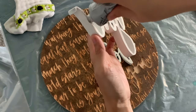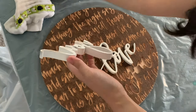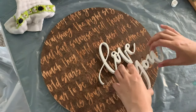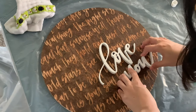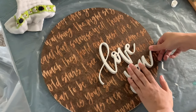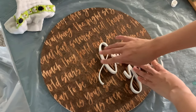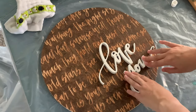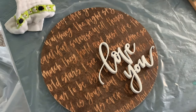I went around the edge of my round with 220-grit sandpaper to smooth everything out, and lightly sanded inside the pocket. Since the sign was going to hang inside, I used a mineral oil finish on the backer instead of urethane — I love the richness it brings to the wood — just one quick coat to rehydrate the wood. Then it was time for the glue-up. As a crafter, I love E6000 glue — it adheres quickly, takes about 72 hours to fully cure, and the letters just snapped right into the pockets without any measuring or lineup.